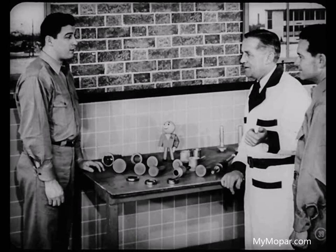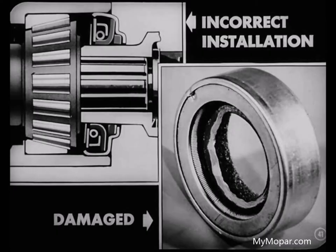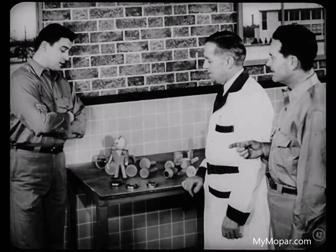That's why you'd better keep those seals absolutely clean whenever you install them. There are spring-loaded rubber seals at the torque converter impeller hub and the converter turbine shaft — both places have high temperatures and high rotating speeds. Wherever rotating shaft speeds are high and runout is a factor, that garter spring is an important part of the seal. Ben and I had better give you some tips on removing, inspecting, and installing seals correctly.